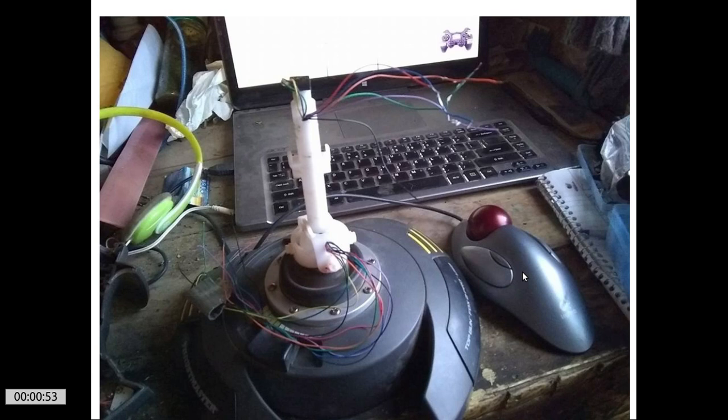And I had been seeing on the internet where people have been interfacing mice with Arduino boards, and there was an Arduino joystick program. So I added wires, because I took the controller out of this joystick, and all this joystick is now, and this is why I'm adding extra wires and stuff to go to all the buttons, is buttons and potentiometers, and the USB controller that Logitech put in it is gone.